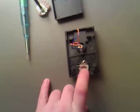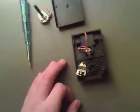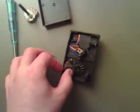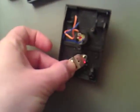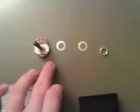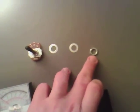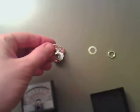There's a screw inside the selector — I've taken that off as well, just for ease of use. I can show you quickly that the screw in the centre, as you take that off, you can then remove the knob. The potentiometer has two washers and a nut. If you grab one of the washers and just place it over the top.